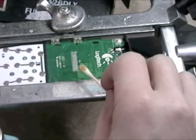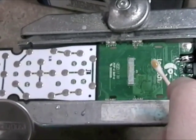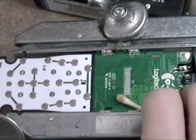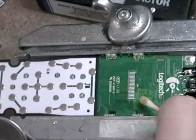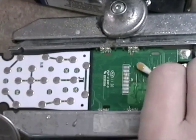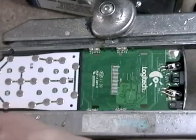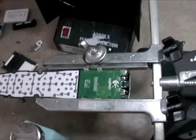You can leave some solder there. Some of that is solder, and some of it is still Chipquik alloy mixed in with it, but it's not enough to cause any problems. Don't try to work it all off, because you could damage or lift a pad. This is fine. And that's it for this video. The next step will be to install the new LCD.